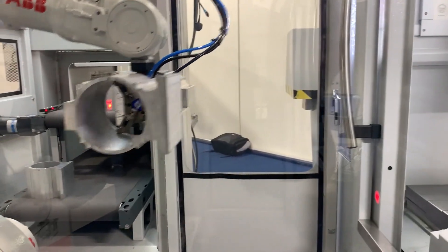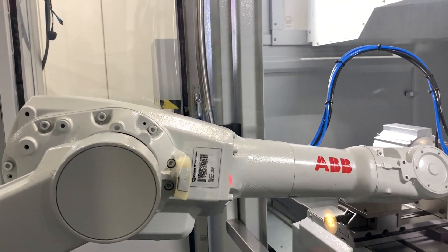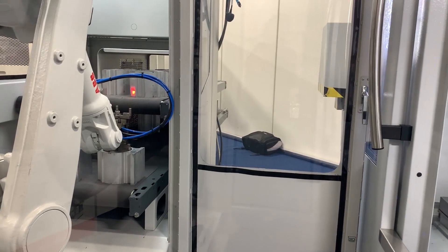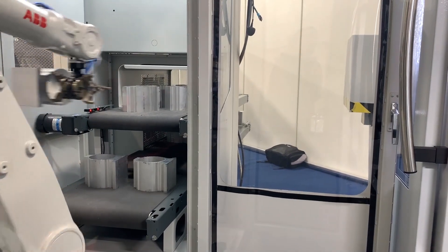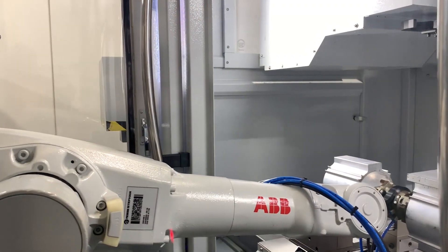So you're getting more cutting time out of your machine tool. So if you're putting it on a conveyor with a vision system, I'm presuming you don't need fixtures — you can put them on any orientation? Correct, absolutely. So one of the things that comes from the flexibility of having the camera system and a flat belt is that as long as you can put the parts on the belt, we can see it, we can pick it up, and we can load it into the machine tool.